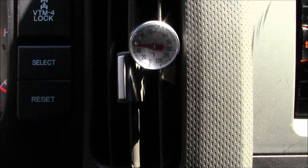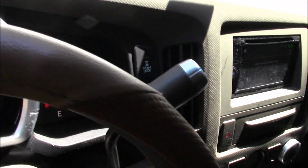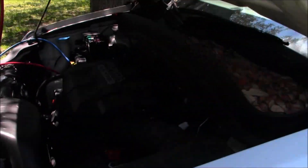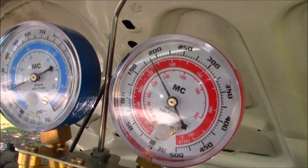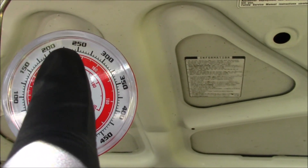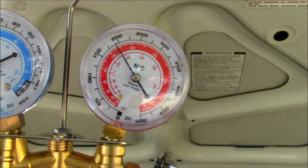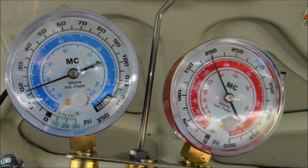That really is the most simple, cheapest, easy-to-understand fix I've ever seen for an AC system - a simple relay that is actually made in the USA has failed at 90,000 miles causing the problem. Now we are at operating pressures: the high side will hover around 180 to 190, come up around 200, then fall back down, kind of staying right around that 200 pounds of pressure mark. On your low side you're going to hover right around between 14 and 17 - at least on my system.